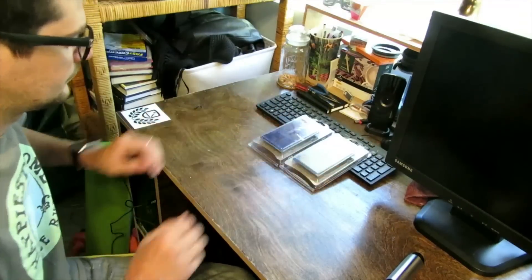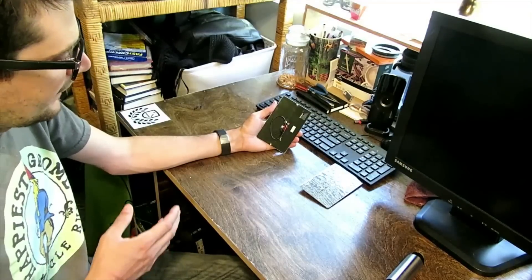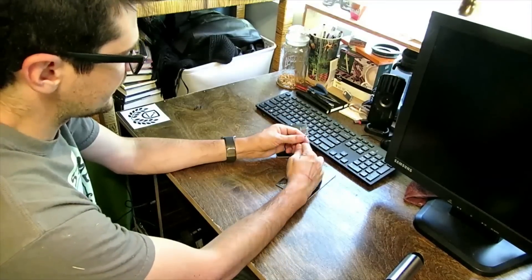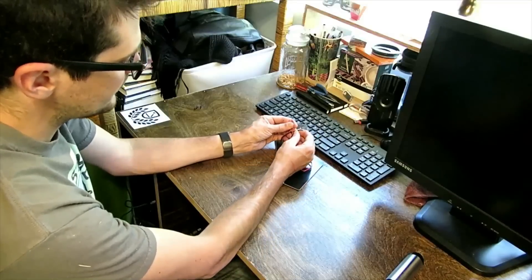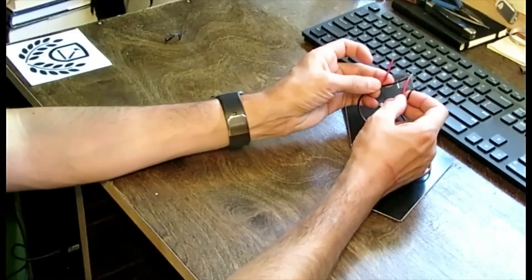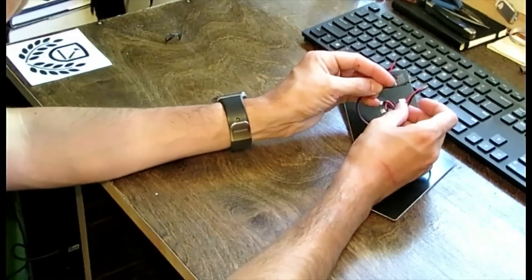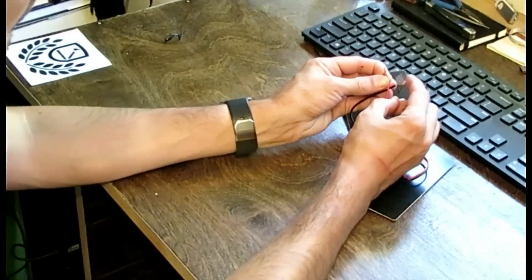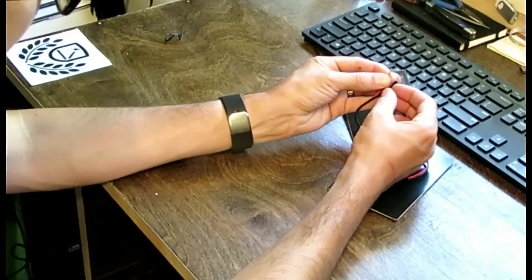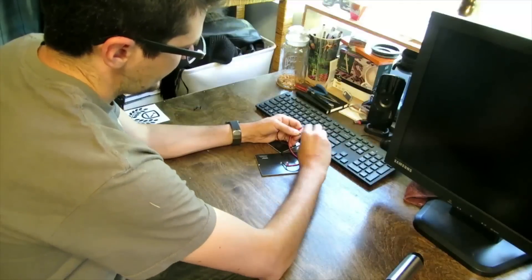Next up, we need our solar panels. We're only concerned with the red and the black wire from the USB cable, and on the solar panels, we're only concerned with the red and black wire as well. We're going to make sure that the reds touch from both of these, and the blacks are going to be touching. You don't want red to black on either side, because that's going to step up the voltage and we don't want that for our battery. So red touches red, black touches black, and you're going to twist these together as tightly as possible.